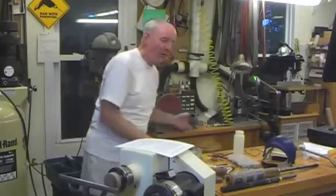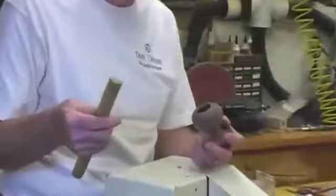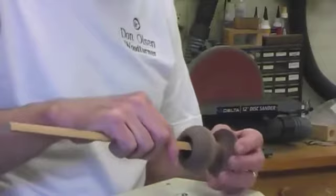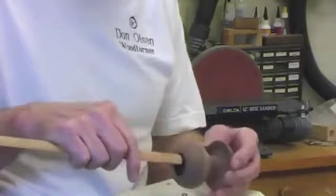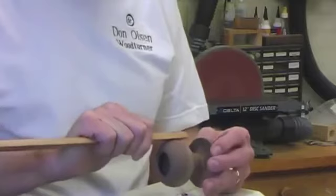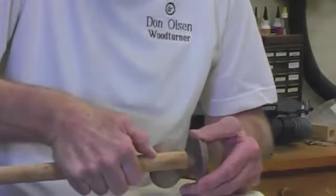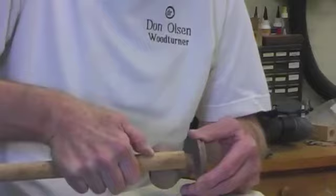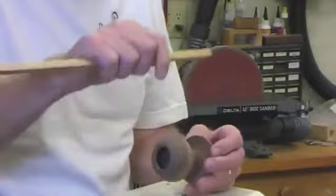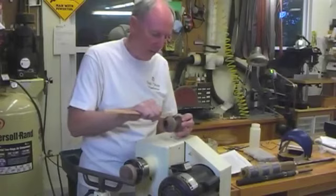One thing I came up with is a way to find out what your wall thickness is. This is half of a 1-inch dowel, and you can mark this in inches if you want. If you stick that in there and put your finger here, then come out and line it up on the outside and look down at it, you can see what your wall thickness is on both sides. You can see the walnut on both sides of the maple dowel. I think it's handy. And if you have a couple of these, you can go in a little bit further with it. That's another way of quickly measuring. You can go in and come back out, and you go, oh, man, it's pretty thick, so you want to take off a little. Just a little bit.